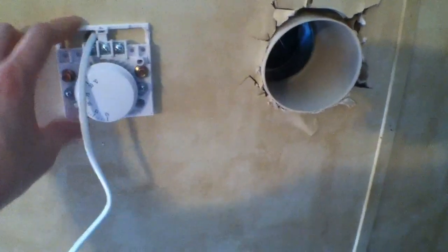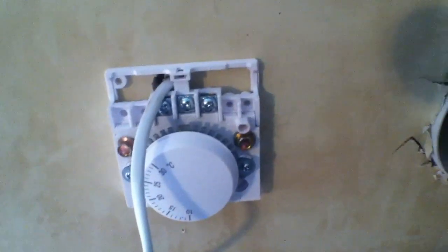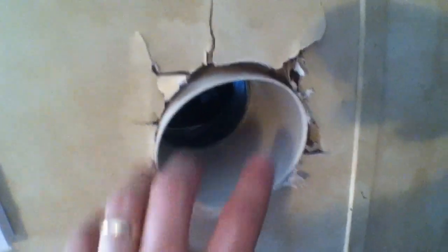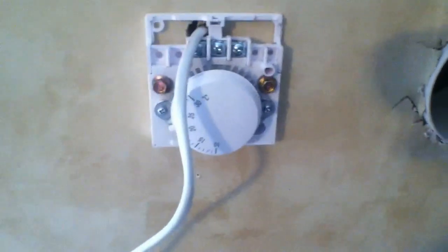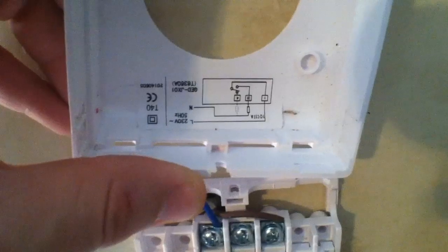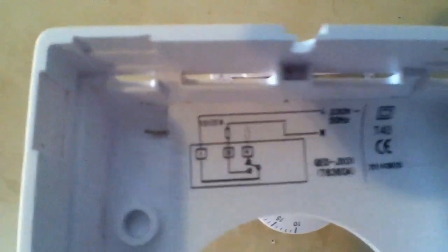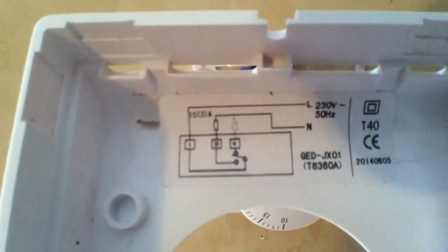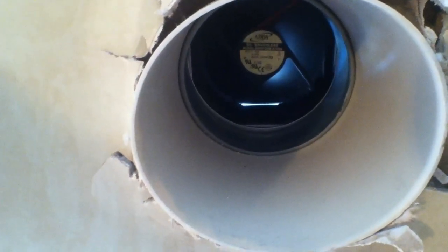We're back inside. We've got our thermostat mounted onto the wall. I'm going to stub these wires back into there, get that wired appropriately, and then get the cover — I'm going to cut a cover plate to go over that. For how this is wired on this particular unit, we've got contacts one and three. Three and one is marked appropriately, and you can see right there how that's supposed to be wired so the contact will close at the appropriate temperature. Right now we've got the fan blowing in. I'm going to go out there and shut the vent and circulate hot air to see what we can get going.